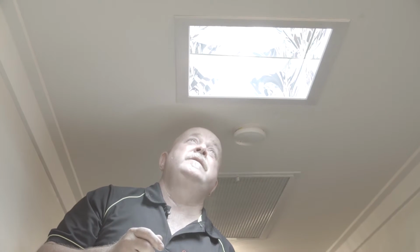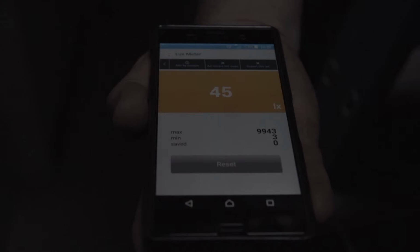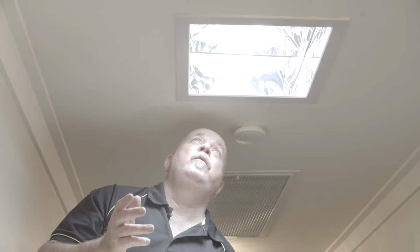This is the 400 by 400 square skylight that was in the passageway earlier, that was quite dark and was only sort of bringing 150 to maybe 200 lux down through. It's a fairly significant drop for a 400 by 400 skylight. It's almost 3 metres from the ridge. Normally you would go for a larger skylight, but to get the comparison, we left it at 400.